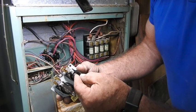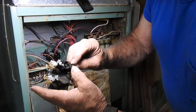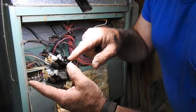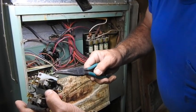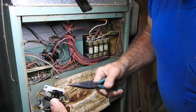If you take a look, there you can actually see your burnt contacts. Can you see the burns and the pits on those two contact surfaces right there? And there's the pin I was telling you about right in the center — the pin that pushes up from the bottom when that thermodisc warps from the heat by the little heater that the thermostat sends to it. And that's what closes that electrical switch.